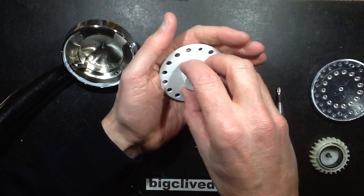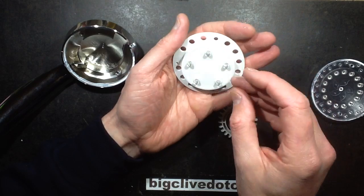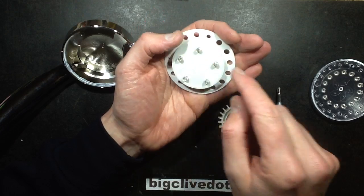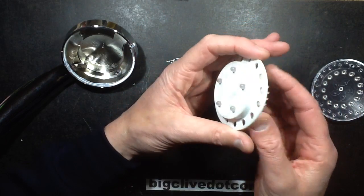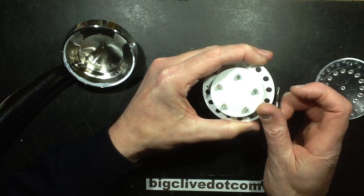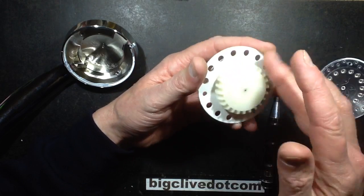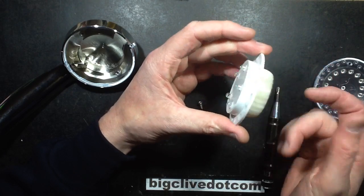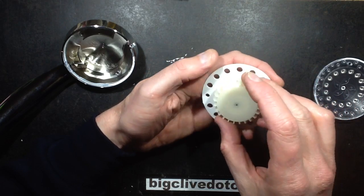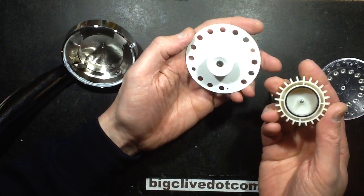In this case it's a stator — because the rotor is the one with magnets on it — with the windings on it, and they're probably going through a rectifier in here, and a small smoothing capacitor, and then just the LEDs. These LEDs have no intelligence — it's not doing anything smart. When it spins, they just flash through the colors — they're just generic LEDs. So it's going to be super simple. But having said that, it's better designed than the first one, so there's a good chance it's actually going to last quite well, because it is so sealed there's just nothing to corrode.